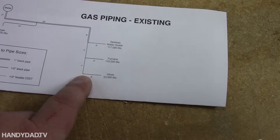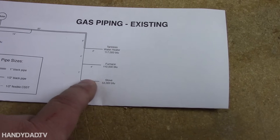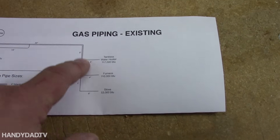Typically, the easiest way to install another appliance is to go at the end of the line, disconnecting the most recent pipe and adding on to it. But because I have such a far run through my garage, I didn't think that would get approved. I spoke to a friend who is an HVAC guy, and he said that judging from the number of appliances I have, if this were new construction, I would have to have inch-and-a-quarter pipe coming from the gas meter. I was hoping they would approve this plan without having to run a new gas main all the way through the house — that would have been a lot of work.